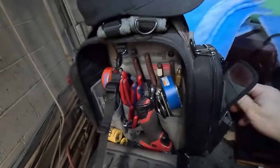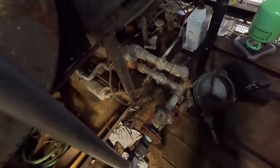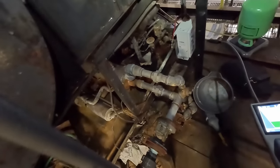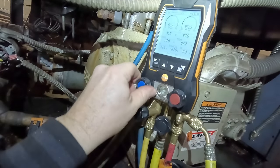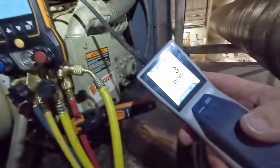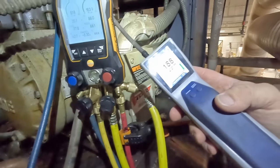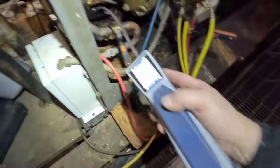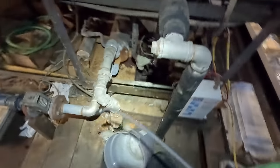Let's see if that pop-off — oh wow, we're already leaking something fierce. Go to high — that's great. Go to low — that's great. I don't know if I'm leaking on that, could be leaking on my valve. We're at eight pounds, let's go ahead and stop adding. We can go to parts per million and see how bad it is. Oh crap, look how bad that is — we're at the 200s up top. That's the last thing I need.